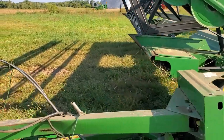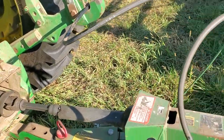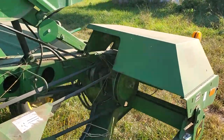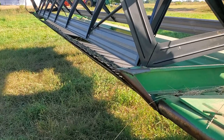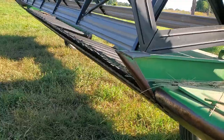With that out of the way, it's kind of a basic implement — you've got your PTO shaft. I changed all the belts out in here; there are ways to tension them but it's pretty straightforward. We also pulled out this cutter bar because it was all bent and replaced all the guards and the knives.